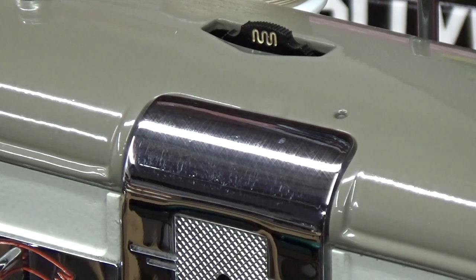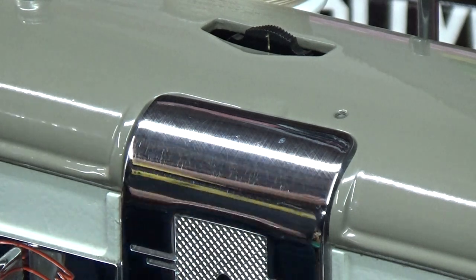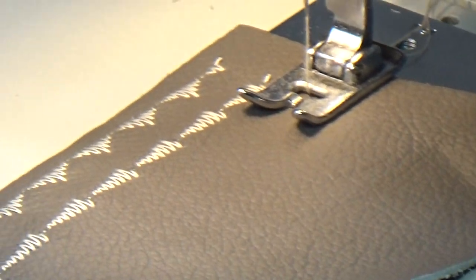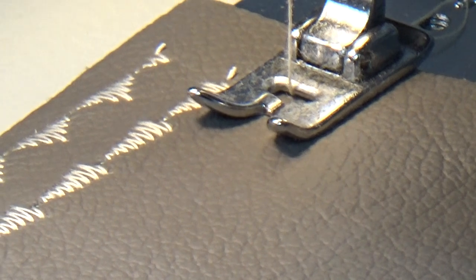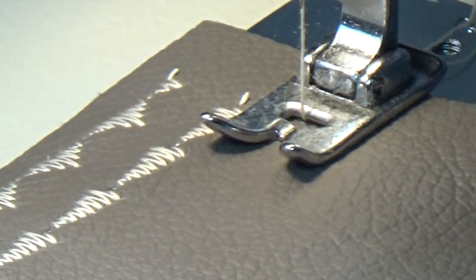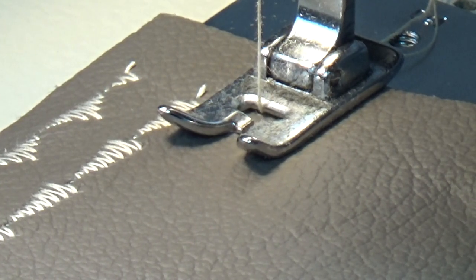Because we've got the cam in the machine, we've got cam D, but we didn't do what? What if we sewed right now on that leather, what would we get? The snaky pattern, exactly. So we need to move now the daisy wheel thingy one position to the left, which gets us to position one. Now we're ready to move down to the needle and to sew the first stitch pattern on cam D. Once Scott stops moving the camera, and I'm actually not even moving the camera. I think this tripod has maybe some sort of a malfunction in it or something.